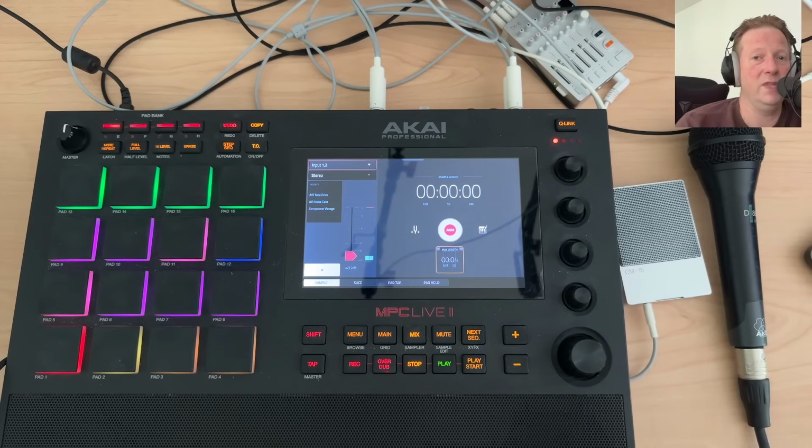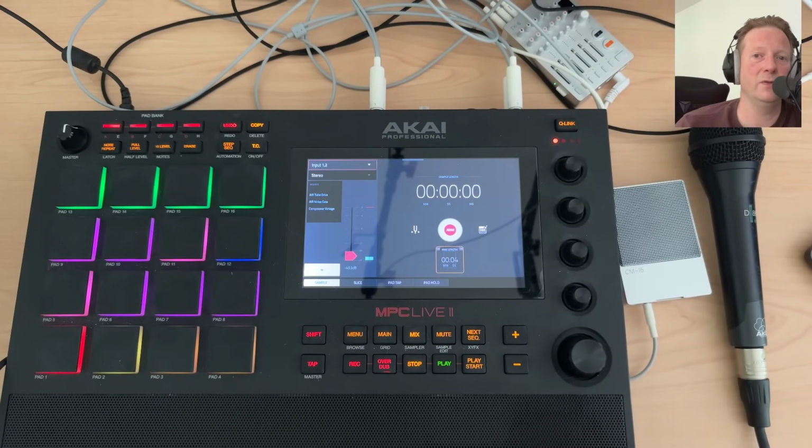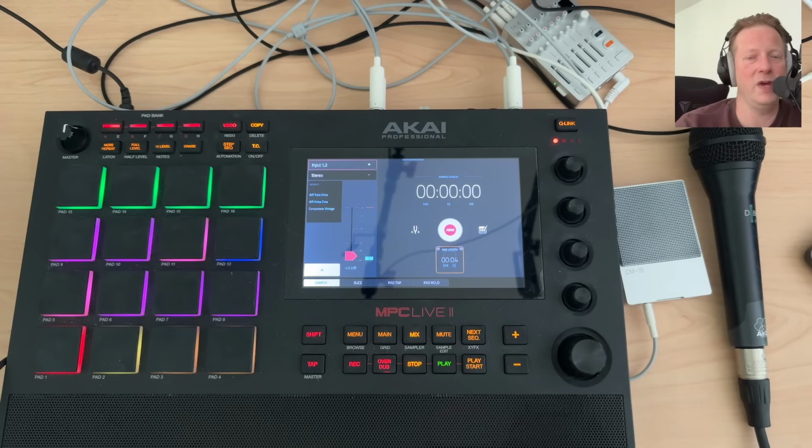So, with that said, the Shure SM7B that I'm talking into right now is going into a Cloud Lifter. This is basically taking phantom power and doing a good job of increasing the volume and signal of the microphone without raising up a lot of noise. Because when you're amplifying a signal, you're typically going to increase the line noise or signal noise and have a higher noise floor. So you're going to get more hiss from background noise, the electrical environment, magnetic fields, wherever you're picking it up from. And so I've got the Cloud Lifter as the first device in the chain.